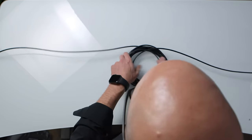So what I'm gonna do is take this coil that we've built, and we're gonna spread it out. And what we should see is that there's no kinks in it, and there's also no twisting of the cable overall. So we have a positive and a negative coil, or an over and an under coil. As I spread them out, we'll see that we've actually created a way of just wrapping up the cable neatly into one big snake that when pulled tightly has no twists in it whatsoever.